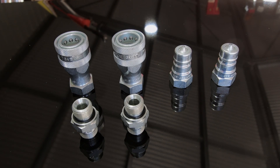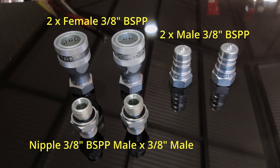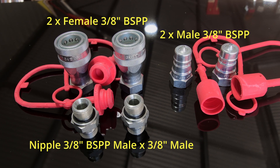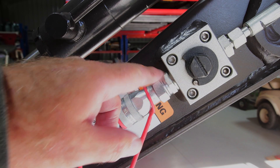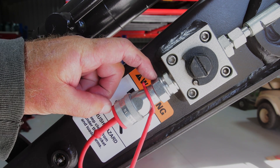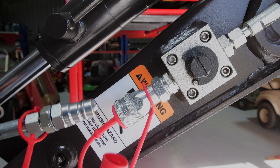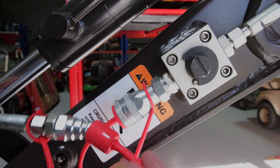This is what you're going to need to do your conversion. You're going to need to buy two female quick connect couplers — the size is three-eighths of an inch and the thread is BSPP. You also need two of the male connectors in three-eighths of an inch, and two of the nipple couplers in three-eighths of an inch as well. In addition to that I would also suggest buying the rubber dust caps and putting those on when you're not using the attachments — it keeps everything nice and clean. The new BSPP nipple coupler was only about seven dollars, the female quick connects were about thirty-five dollars, the male end was about eighteen dollars, and the rubber dust plugs were two or three dollars each. So that's all pretty cheap.